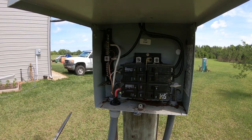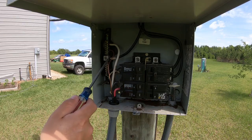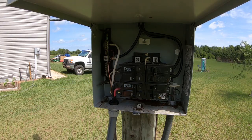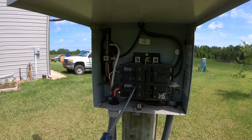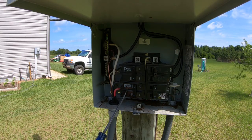So there it is. I got my red and black hooked up to my 50-amp breaker, my neutral hooked up to the incoming white tape neutral lug, and my ground hooked up to that bar. Now I'm going to kill this 30-amp breaker because if I didn't, I'd technically be 10 amps over what this box can handle. So I'll kill the 30, cut that wire off underground once we hook up the other camper, and just run this 50 and this 30 out of the 100-amp box.